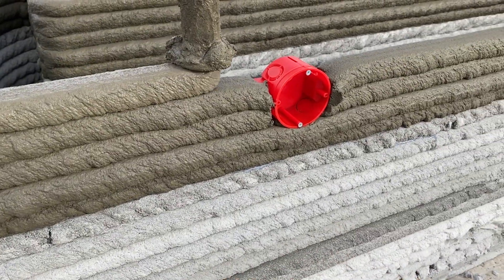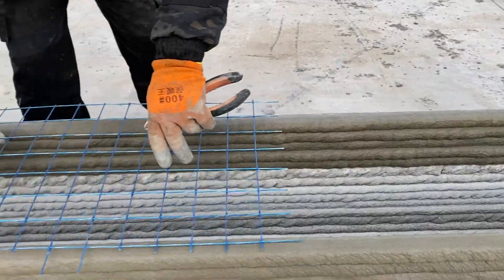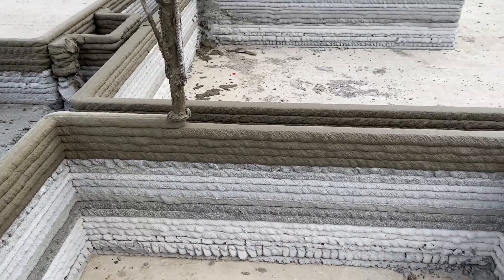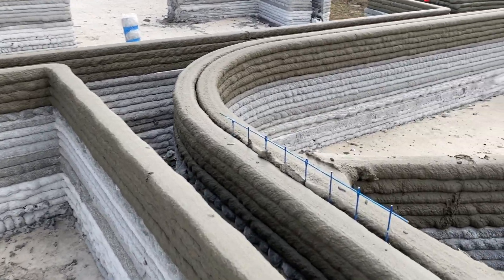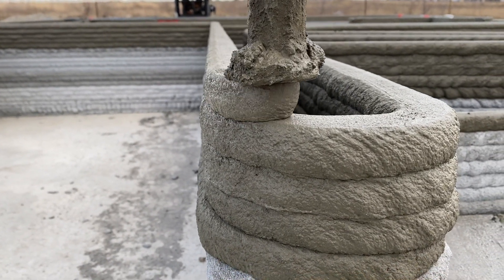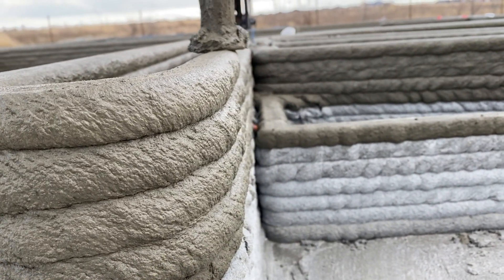After the wall is done, an electrician will feed the wire through directly from the top. Install on the horizontal reinforcement is also quite simple — you really just place it there in the wet mortar. Between these two conjoined walls on the right, they also have some of the same material being used as vertical reinforcement. Let's see what happens when the printer gets to navigating around that vertical reinforcement extending above its height.